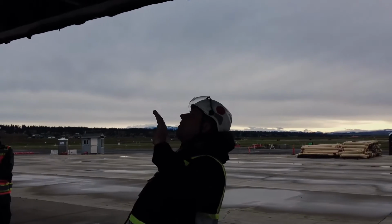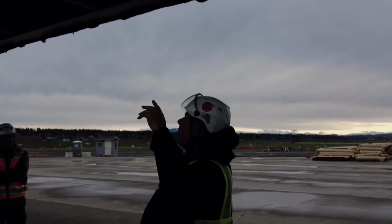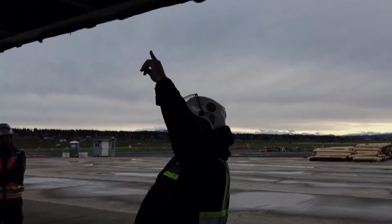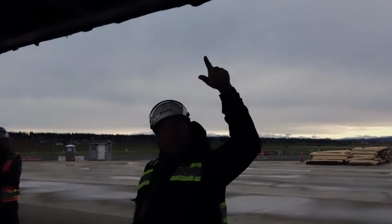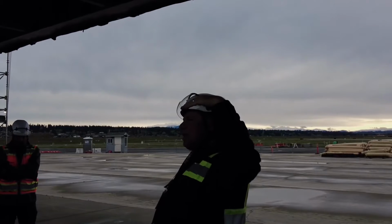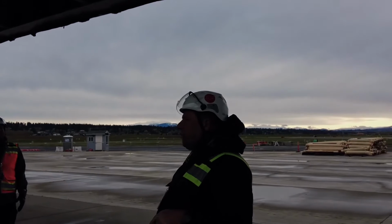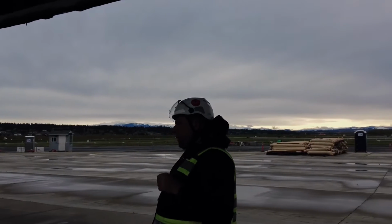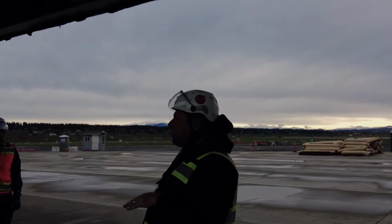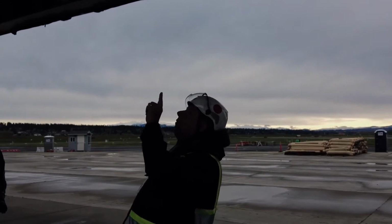But if you have to get to a box or sprinkler head above it, most of those things are going to be at the roof deck above. The girders are 6 feet deep, and the arch beam at the center tapers to 4 feet. So you have some distance to scale, and you'll need to get the bucket closer. One of the recommendations we made a while back was for a specific type of JLG lift with a long boom arm, because if you've seen the floor plans, you know there are a lot of obstructions that will prevent you from getting directly underneath.